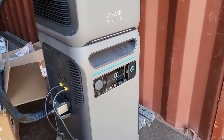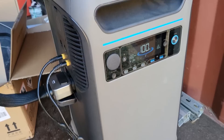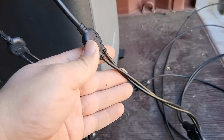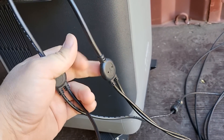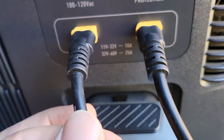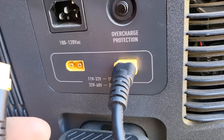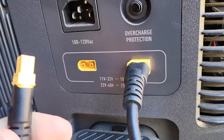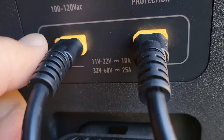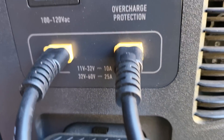That comes into our container where Oli's got an F3800 plugged in — unfortunately it's at 100% so we're not really taking advantage of what we could. We've got two different arrays — the nicely assembled one and that temporary one — feeding into our two XT60 ports. We can bring in up to 1200 watts per XT60. We have to stay within specific voltage ranges, which is why we had to run some pretty heavy-gauge cable.